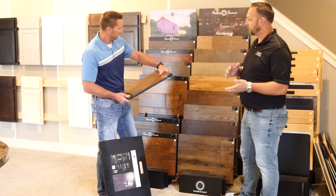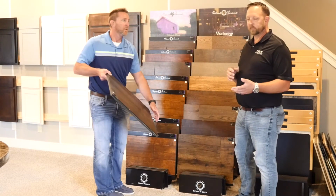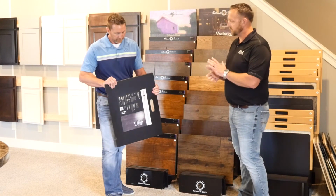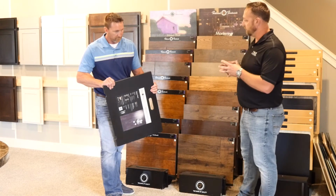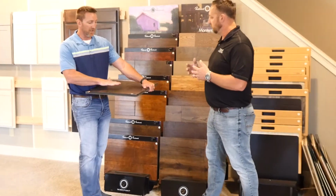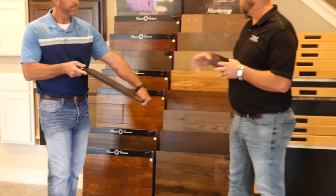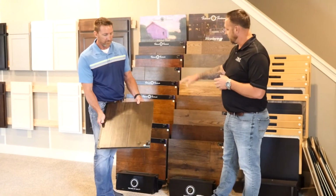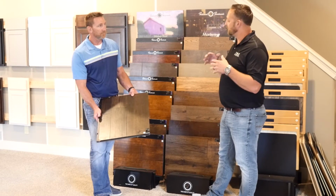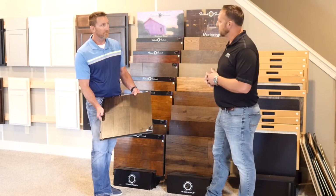Each product line is a little bit different, but typically they'll come with about 6 layers of plywood on the bottom side. They crisscross each other, so when it accepts humidity and moisture, it fights itself from moving. It makes it more solid, so it's basically layered. Yeah, okay. So it allows these 6 to 8 inch planks, most of them are 6 to 8 inches anymore, to stay flat and level, not heave up, and not have the gapping that you would have with a typical solid hardwood floor.